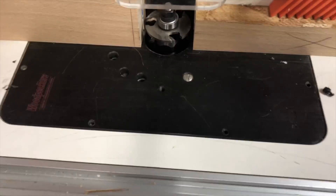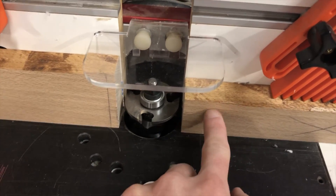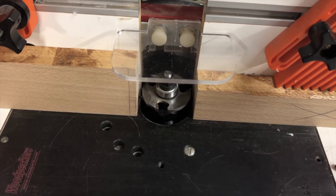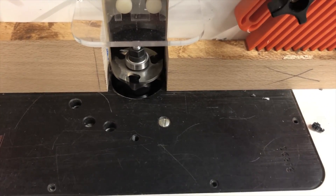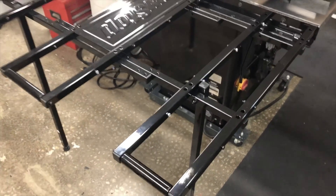There are a number of ways you can cut this groove — I just did it on my router table. This stuff cuts like butter. I used a router bit and had to set up a little auxiliary fence because my router fence didn't slide forward far enough. Do a test piece first just to see the depth you need to match the screw head and the width. Once you get that set, it's easy to reproduce.